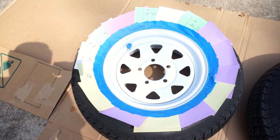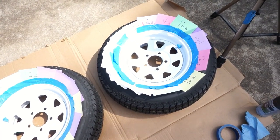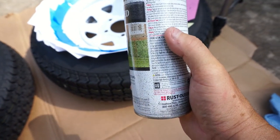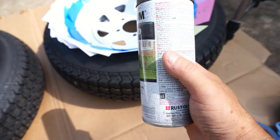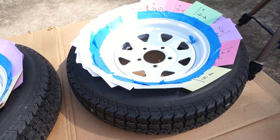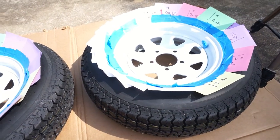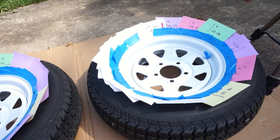A good paint job, no matter how cheaply done, starts with preparation — that's what takes more time than the actual painting. Also, read the directions on your spray paint. This particular one — a lot of people complain about different brands — you really have to read the directions. It says you need to recoat within one hour or after 48 hours. So if it's been an hour and a half or two hours and you think you need another coat, don't do it — it's going to crinkle your paint and you'll have to strip it all the way back down. Wait the full two days, even three days, before putting another coat on. There are other spray paints that are more forgiving, but if you read the directions and know how to use it, you'll get a good coat out of any spray paint.